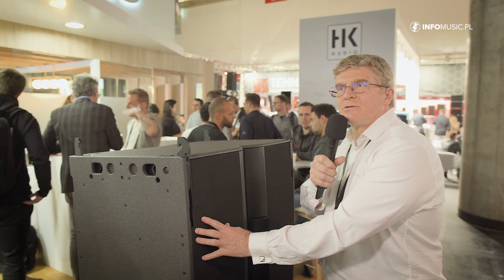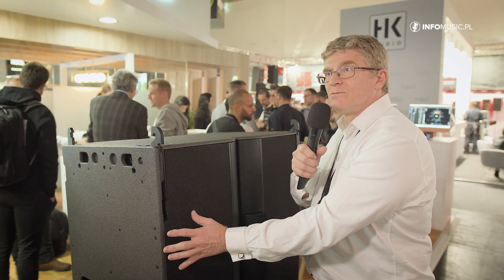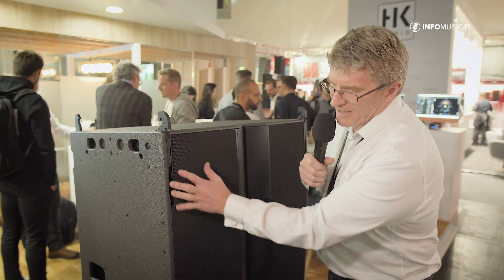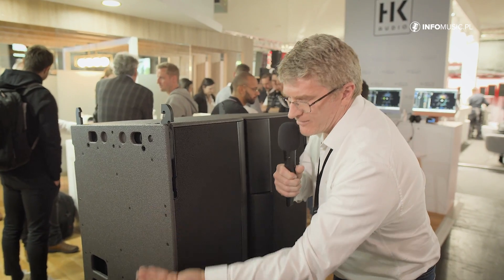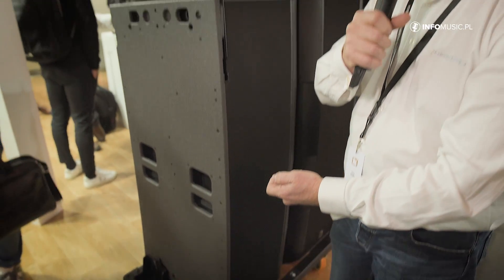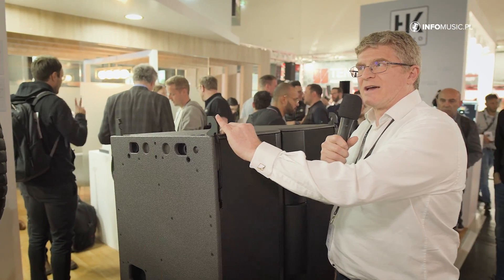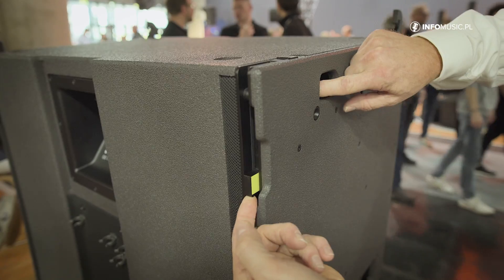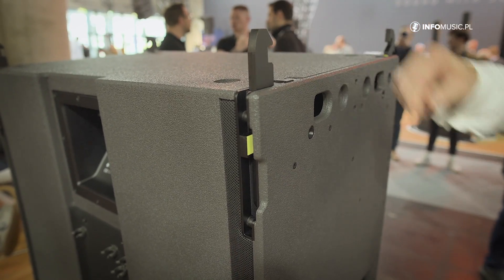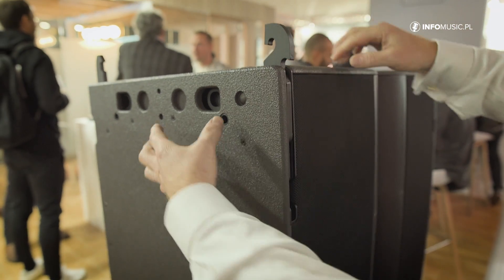We're comparing this to the K2. It's very close to being equivalent to four K2 cabinets. With K2 you would have four cabinets and lots of rigging to do in between them — lots of pins to work with and angles to change, which is a lot of work. With the L2 we've taken that away. We just connect them straight together with no angles, and it's a fast rigging system — at least a third, if not a quarter, of the time compared to K2.